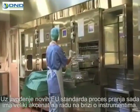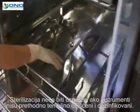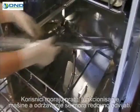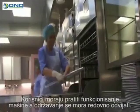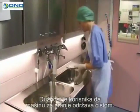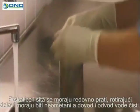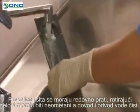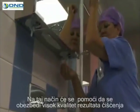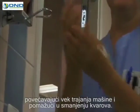With the introduction of new EU requirements, the washing process has been given greater emphasis in the work of instrument care. Sterilisation will not be successful unless the instruments are first cleaned and disinfected. Users must be able to monitor the machine functions and regular maintenance must be performed. It is the duty of the users to keep the washer disinfector clean. The wash arms and the bottom sieve shall be cleaned regularly, the delicate rotation of the washers kept unimpeded, and water inlets and outlets cleaned. A log shall be kept of all monitoring and maintenance work performed, which will help ensure a high-quality cleaning result, increase the machine's working life, and help reduce malfunctions.